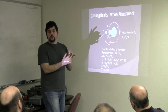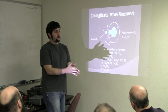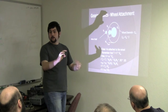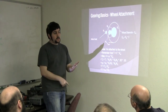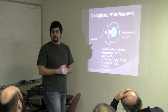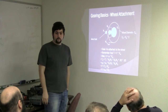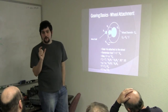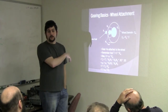Yeah. I mean, when it comes to gear trains, the fewer reductions you have, the more efficient the drive is going to be. The more steps between your motor and your gear, you're going to lose power at every step, and that's due to heat and misalignment. And those are used in large humanoids. That's the main purpose for that drive train. Okay. 5-foot, 6-foot humanoid. I've seen some small ones, but I've never really found an application to use it over some of the other ones.